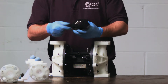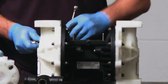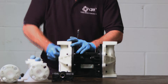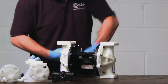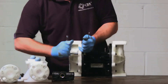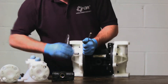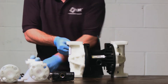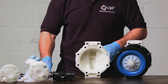The air chamber is then released with the four fixing bolts. You can then remove the fluid chambers by releasing the eight bolts around the sides. With the fluid chamber removed, you can inspect the diaphragms. If these are damaged then they can be replaced.